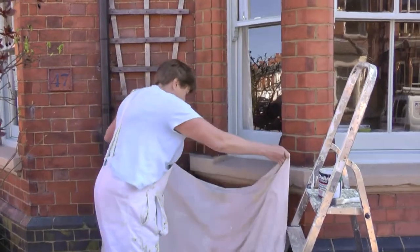If you feel that you are getting draughts through your sash windows, the best way to prevent that is to put secondary double glazing which is fixed to the inside of the house. That will form an air gap which stops the cold air from coming in and prevents the warm air from escaping, and you are doing that with a sheet of perspex or glass which can then be removed in the summer once the weather improves.